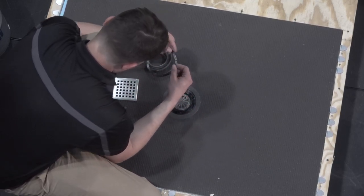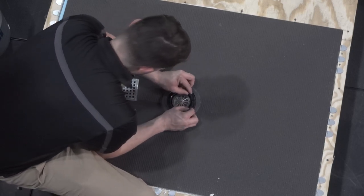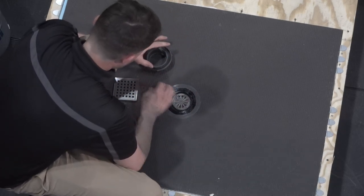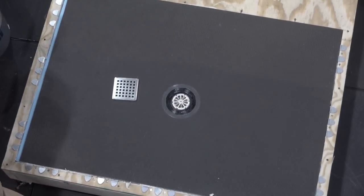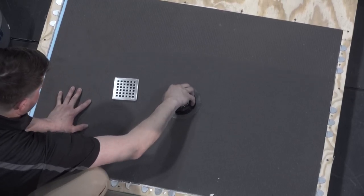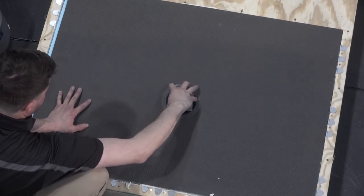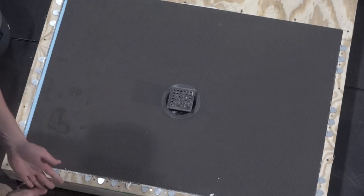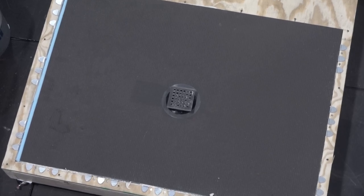One last point on the Click and Seal: if you have access underneath your shower, or during install you need to back off that drain assembly — this is very different from a lot of the competition — you can take that drain assembly off from underneath the shower base without disturbing tile or your installation at all. If you ever have to do a repair, have a plumbing issue, or need to make adjustments, you can do that without damaging the product. Put a new one on, or make whatever adjustments you need.